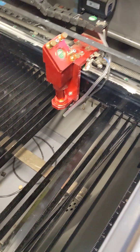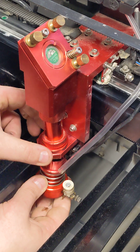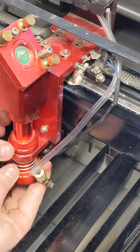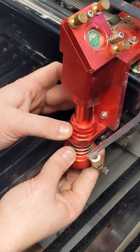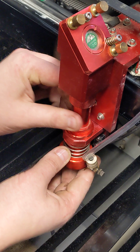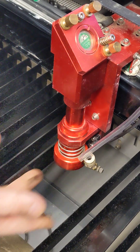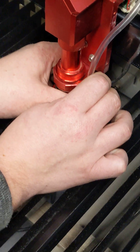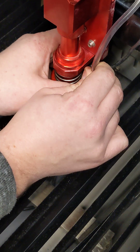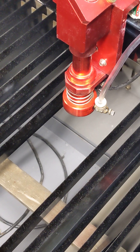Next is just the opposite of how it came out. Take the lens, slide it in the holder, screw it down with the lens retaining system, and screw that tube down so we have a laser lens that's properly seated in the housing. Now just push your air hose back in — and that's how you clean the laser lens on the Boss 16-30 laser.